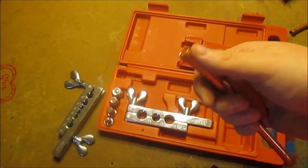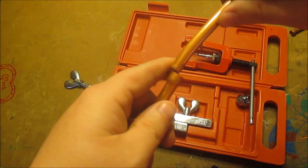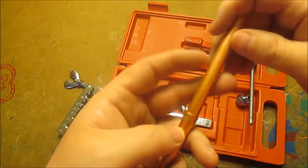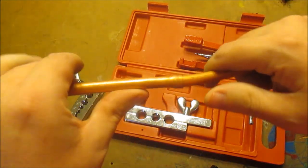Some people call it 'swedge,' some call it 'swage' — but as you can see, it fits in here now. I wouldn't have to buy any fittings — I could solder that and it would work. Save a little money buying connections and whatnot.